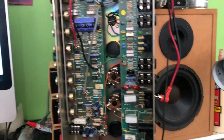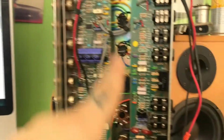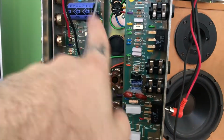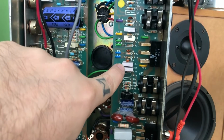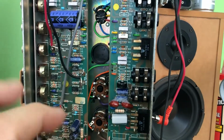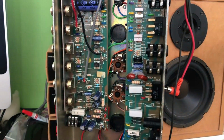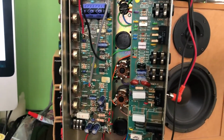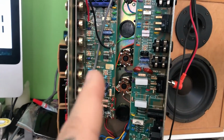The other thing I wanted to check, because I did look it up before on the schematic, which I won't go through again, is those coupling caps, C11, C12. It's these little things here. Now these things rarely ever fail. I've only ever seen one fail, and it was an X capacitor, a special high voltage thing. You can read up about it online. Look up X capacitors. And it was in that JCM30.